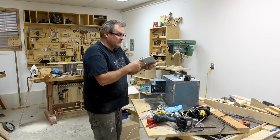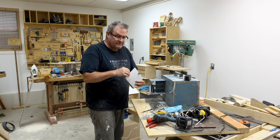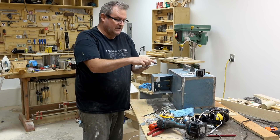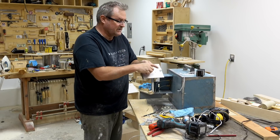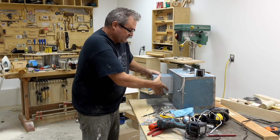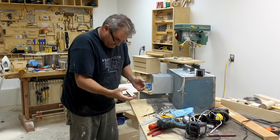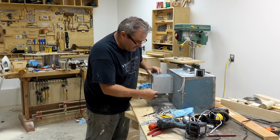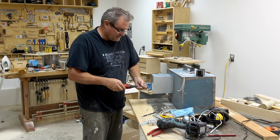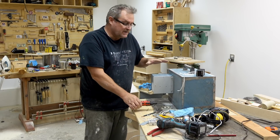The back panel is different in that I made it from a piece of aluminum cut from a larger one — about one-eighth of an inch thick, cut with a hacksaw, then smoothed with a file. I added an angle onto the edge to mount it onto the cabinet, and a little clip on the inside to fasten it to that side of the box. I've already got holes drilled for the relay, but I also need to drill a hole back here for the power cord to come through. Everything looks good, so I'm going to take it all apart and start putting it together with the wiring inside.